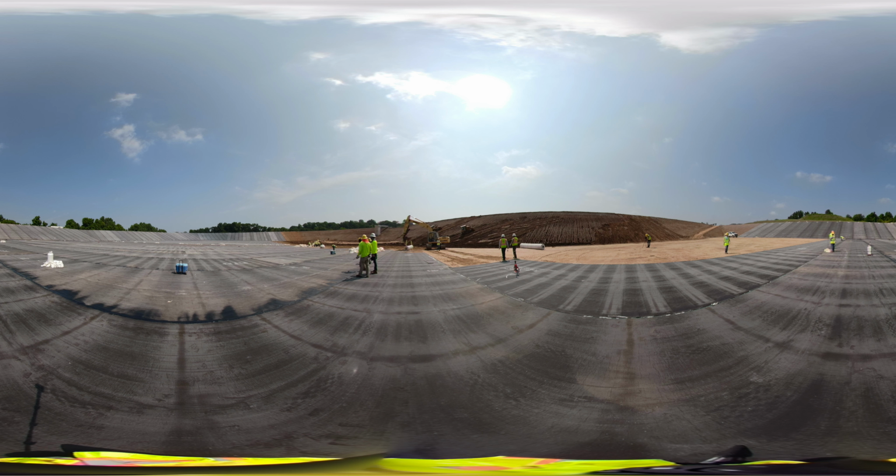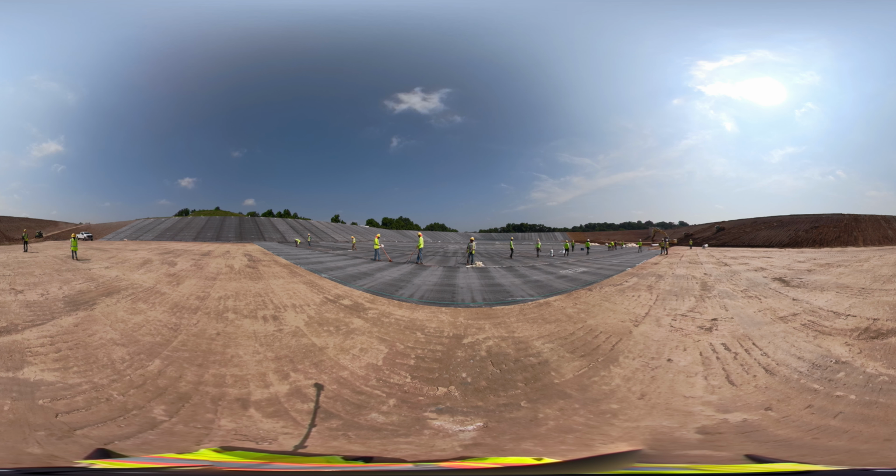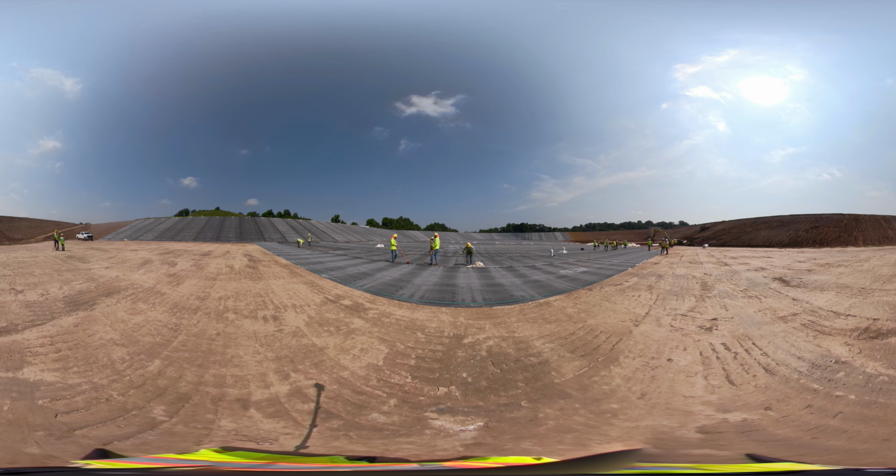Due to the sloping contours of the original property, this reservoir was built by excavating one area and filling another. Three sides of the reservoir were built much like a dam. This and the material properties such as tear resistance, puncture, and friction angle were all factors in the selection consideration of this product for this project.